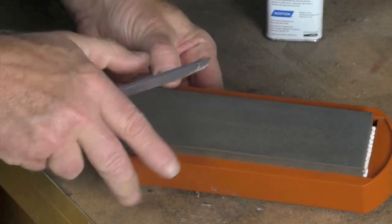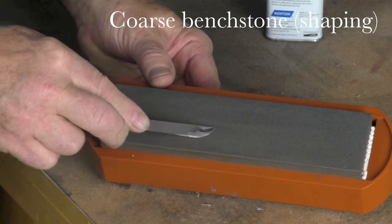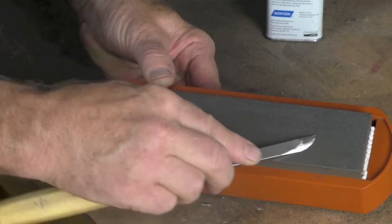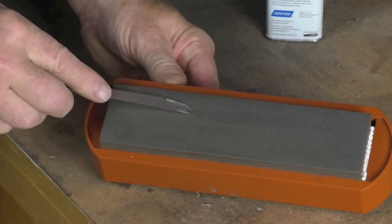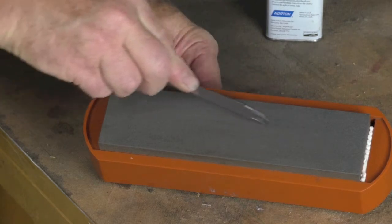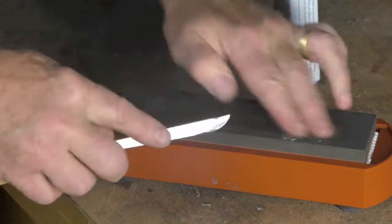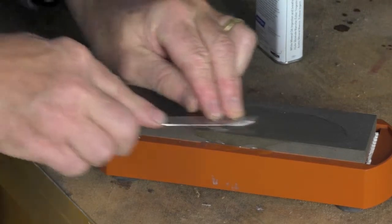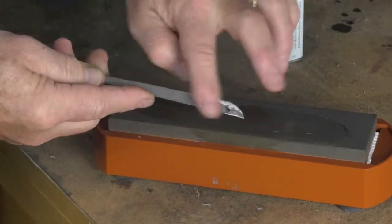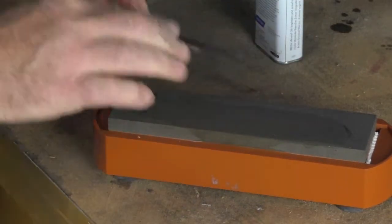This is a coarse bench stone. What I need to do is set it at the cutting angle, which is quite low — 15 to 20 degrees. As I come along like so, I'm going to come around and swing the handle over so that I do all of that bevel. And on the other side, equal angle — I'm going to try and mirror it, coming across like this, swinging the handle. This is an oil stone, so we need lots of oil. I'll consolidate all that grinding from the tip around like this, bringing one sort of bevel, and on this side I'll swap hands.